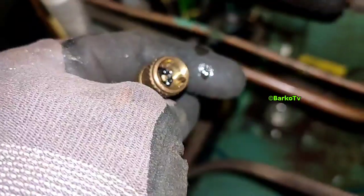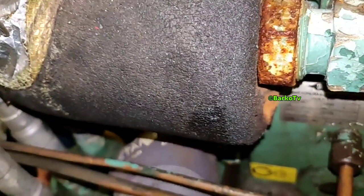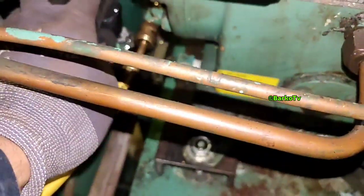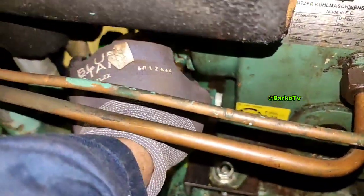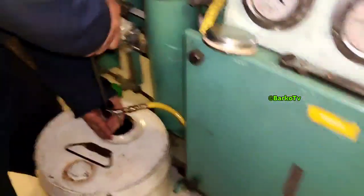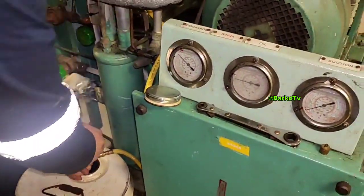The tip at the hose is like a pin — that tip pushes the check valve open. Before you tighten, just bleed it, then tighten the connector so that there is no air at the hose during charging.